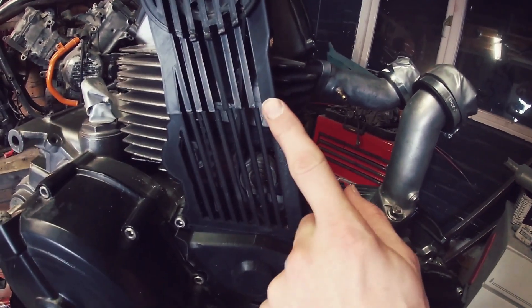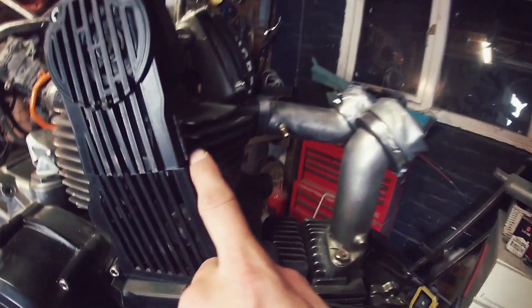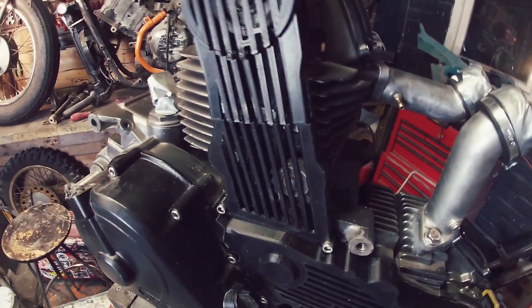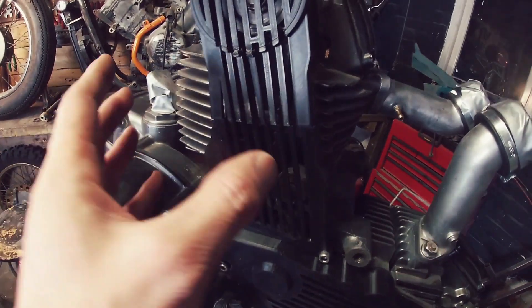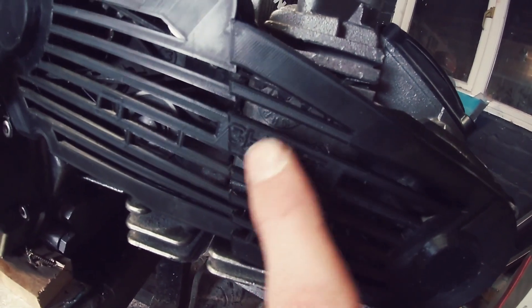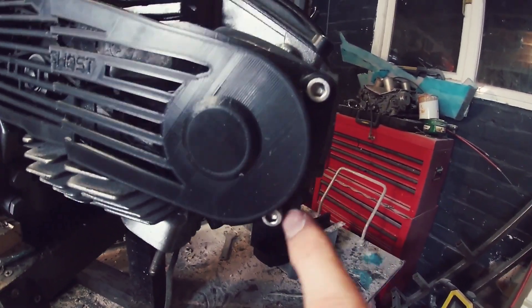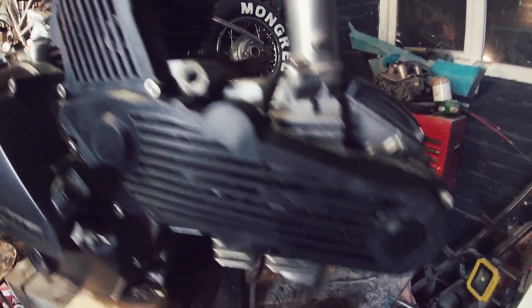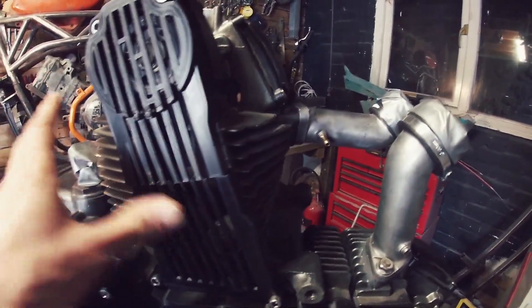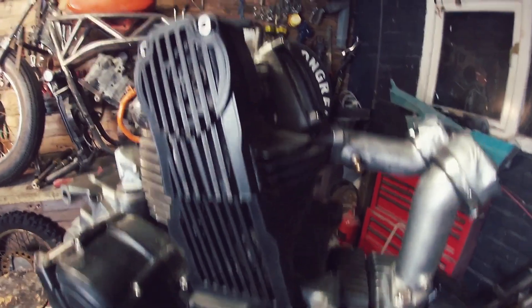You can see here there's a bit of wedging going on between these two parts, and the same down here — a bit of edging. There's a bit of extrapolation that goes on with 3D printing; it's not going to print the most perfect slices. There's going to be a bit of bulging, a bit of movement because this stuff is wedged down tight and it spreads out as it's being printed. Down with that logo it won't print anything that perfect, so there's a margin of error. I need to make sure the distance between that screw and that bolt on my 3D drawings are exactly what it is on here — that's a simple measurement to do. If my 3D drawings are fine against these measurements then I've got no worries, and I'm pretty certain that's all it is.